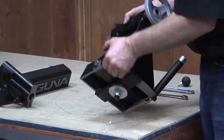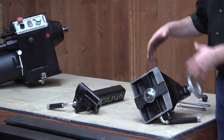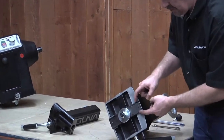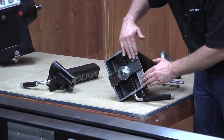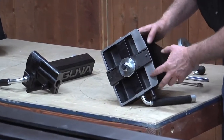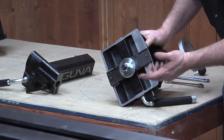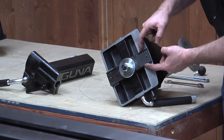We've got the tailstock, the banjo, and the headstock up at the workbench. Looking at the bottom side, you can see there's a runner on the bottom that slides between the bedways of the lathe, and a flat machined cast iron pad that slides back and forth. The cast iron is heavy, dense, and absorbs vibration very well against the hard steel of the bed — those two are a perfect match.